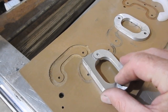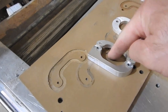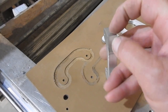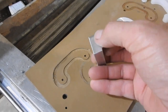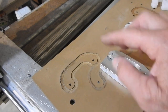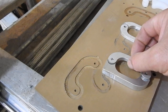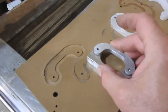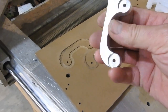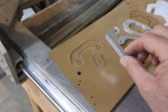Two pieces come together, then the bearings go in, and these stack together with the cam in the middle. The torque shaft goes through here. The purpose of this piece is I drill a 3/16-inch hole down through it and screw in a 3/16-inch male rod end, which literally hooks to the mechanism inside — it pivots and opens and closes the doors. This keeps the piece only able to go up and down; it can't go in and out or twist. I ended up needing to make a left and a right, so I had to make an extra one.